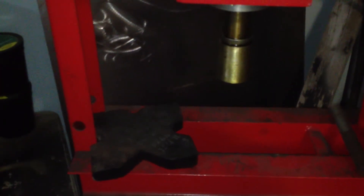That's an oil tank I was working on. If you want to make oil tanks but you want the ends of your oil tank to be rounded — like dished — like these, a friend of mine who has a shop came up with a way to make this die set with these guides that just weld on to keep it square. Then you put it in this press and basically you cut out a bunch of flat circles, put them inside there, and press them into little bowls. And that's the end — that's the sides of your oil tank, which is pretty cool. I'll show that being done in future videos.